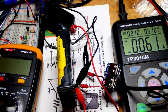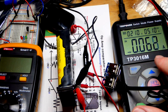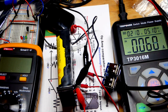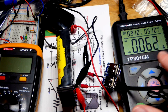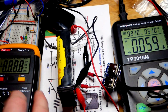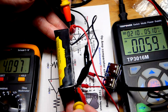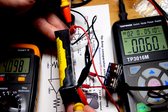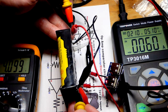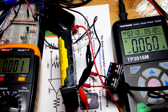Now this was done charging — we had 3 milliamps which I was okay with. But before I could get the camera rolling, all of a sudden we're back to 60 milliamps. The reason I kind of don't like that is we fully charged. But there you can see we got 4.1 and now it is charging it back up. That may actually be okay. We didn't overcharge — we stayed below 4.2 volts. So that is pretty good.